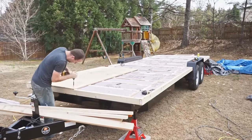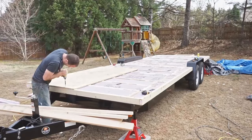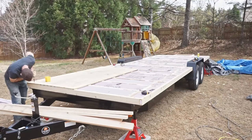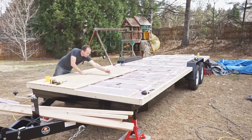The last step is to install the subfloor sheeting. The subfloor sheeting is three quarter inch tongue and groove plywood. We run that down the length of the trailer with the seam staggered every four feet. Before installing each sheet, we run a bead of liquid nails on all of the joists. We then position the board in place and attach it using two inch screws.